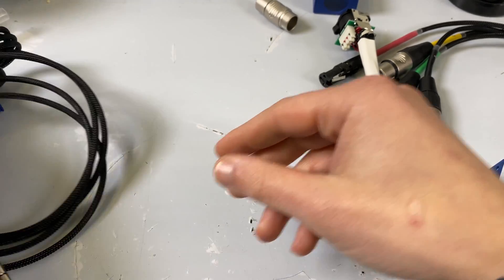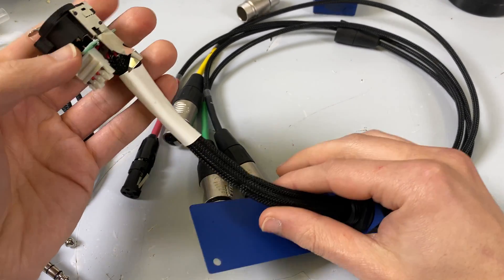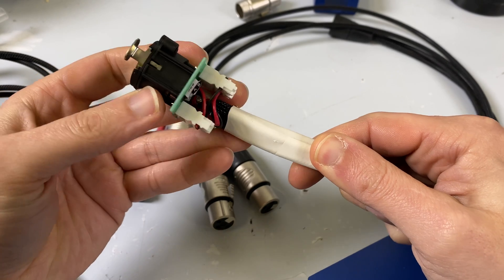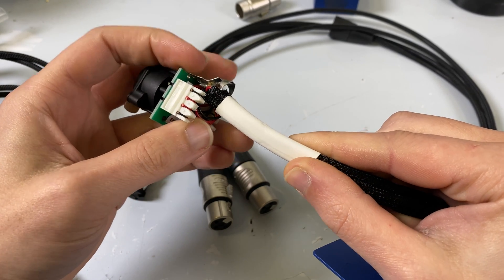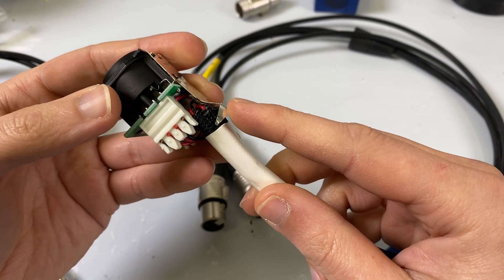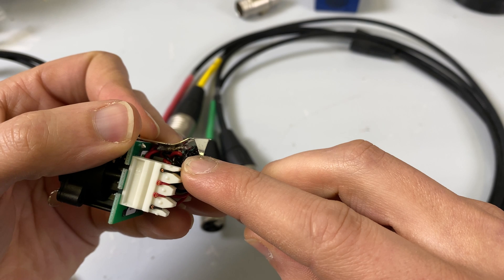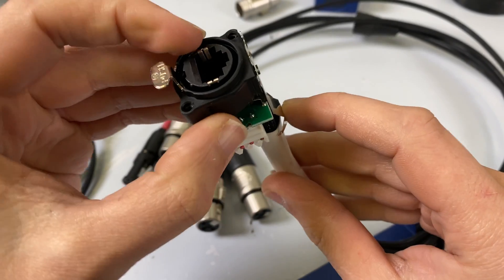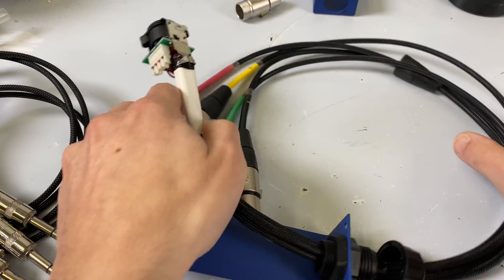In this application we've got a TRS. I've got one of the boxes taken apart — that's XLR — and just wanted to show you how it works. On the back of this EtherCon jack you've got a little PCB and then there's just two little Molex-style crimp connectors. This is the shield. If you look where my index finger is pointing right there, all of the ground lines are tied together and soldered directly to this. The shield pins — these little silver pieces right here — are actually what connects your grounds.